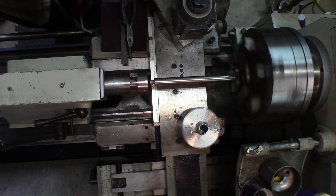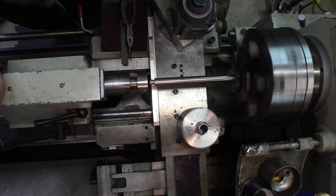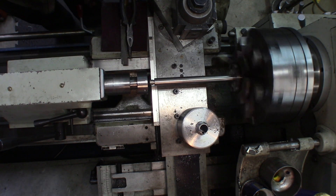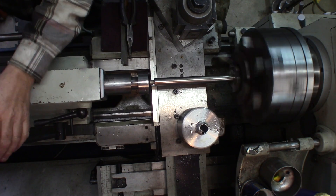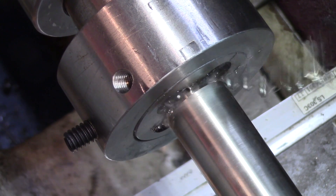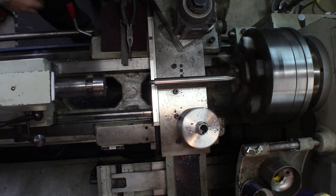Really really easy to make, but I find it a little bit time-consuming. Locking the tailstock — there's a die holder there. I'm turning about 200-300 RPMs. I'm going to get this engaged, and as soon as it's engaged I'll unlock the tailstock. We're right down in — backing it up. One nice thread done.